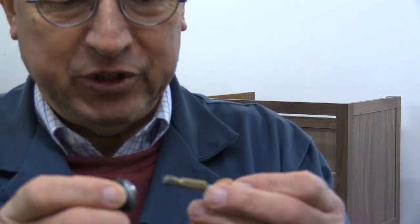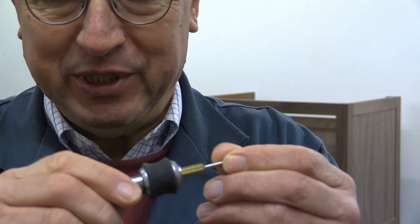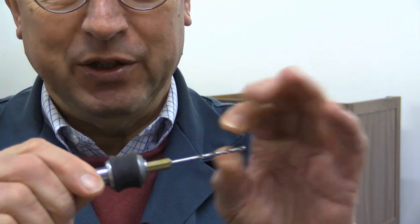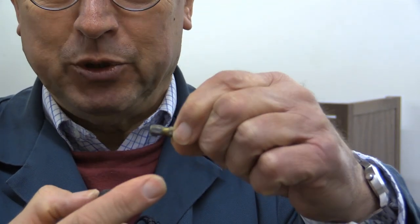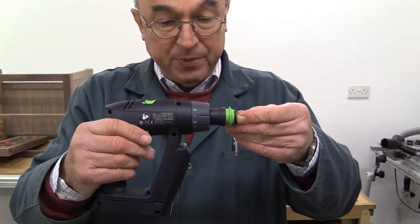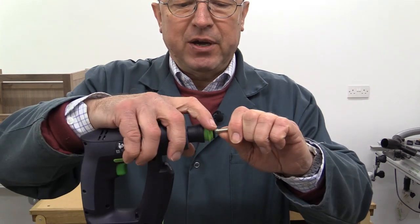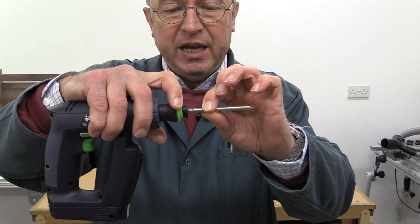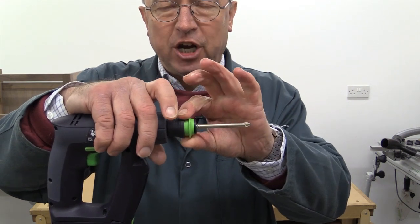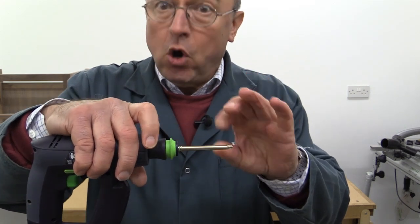It's only when you try to put a legacy drill bit into a legacy bit holder that you realize just how unstable the whole thing is. The problem is there is so little contact surface between the bit and the tool chuck. Now I've got the Centratec chuck fitted to my drill, and in that chuck I've got this Centratec positive drive bit. If I were to remove that from the chuck, look how much goes inside — it's a huge amount, and that's what guarantees the stability of the Centratec bit, whether it's a screwdriver bit or a drill bit.